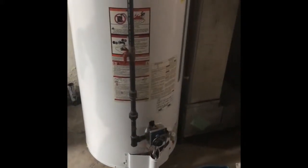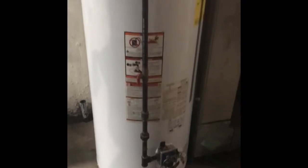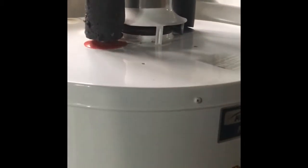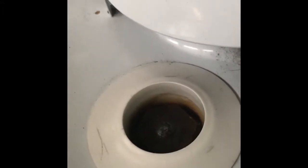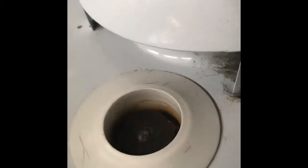I'm going to attempt to take out my anode rod on this hot water heater. What's happening is I'm starting to get smelly hot water, and usually that could be the problem — or is the problem. So I'm going to get my inch and one-sixteenth ratchet and go in here and take it out.